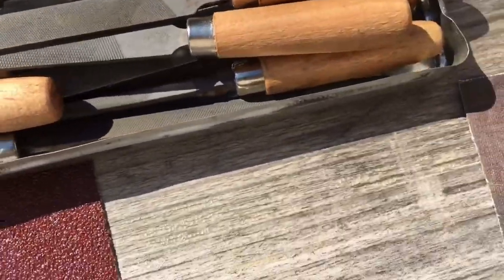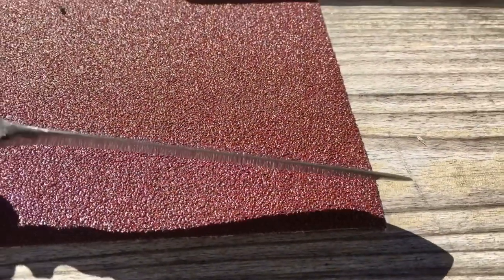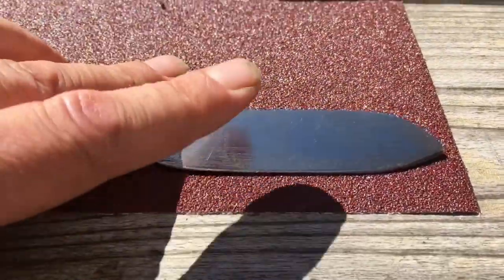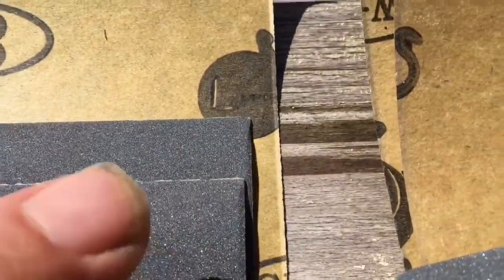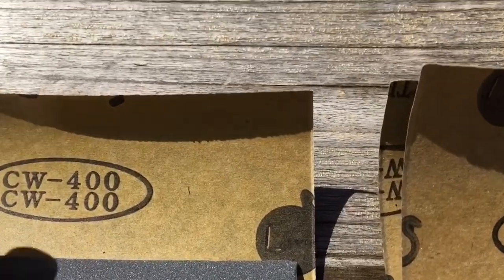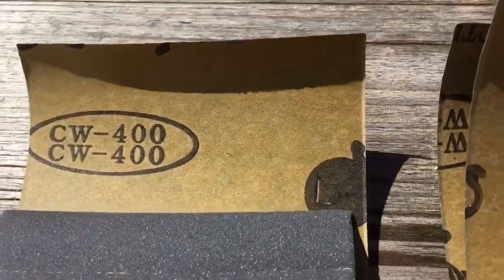So if your blade is prepared this way, it's not sharp yet, but it has obviously no real edge. So this is that far that I can use the 400 grit, which looks much smoother. This is wet sanding paper. If you use it dry, it will lose all the power. You cannot get material off. And the main thing you have to know is if you start on 400, then you have to double up.